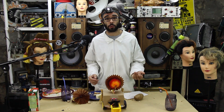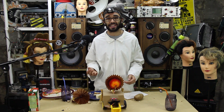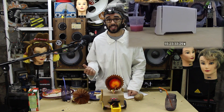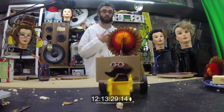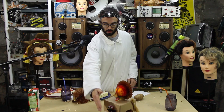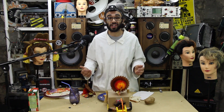We will use an external power supply or battery pack along with an Adafruit motor shield to safely and easily control our inductive loads. Just like in one of our previous videos with the dancing toaster, we can tell the Arduino to turn the Zambrumby any time it is within 25 centimeters of an object. To do so, we'll drive the motors in opposite directions, causing the bot to spin. When the sensor indicates that an object is 25 centimeters or more away, we spin the motors in the same direction, causing the Zambrumby to move forward.